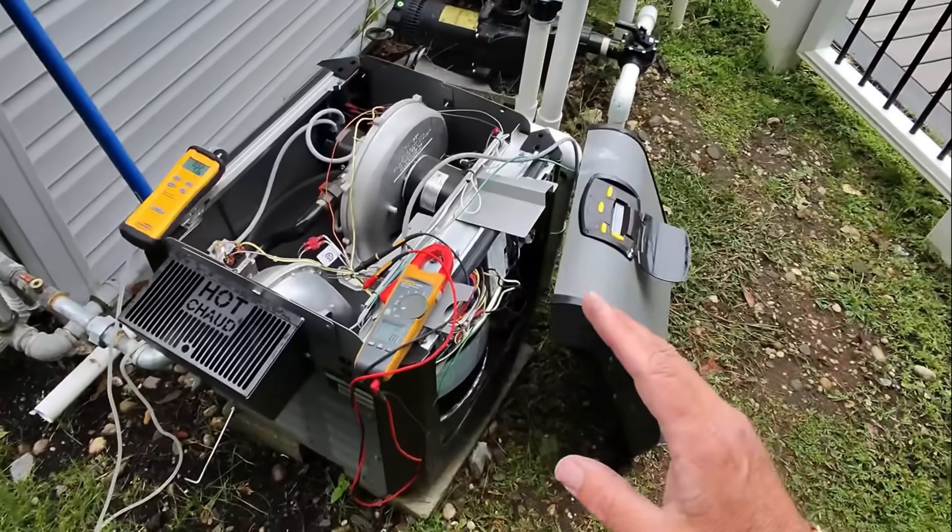One observation: this is a single breaker, which means this heater is wired for 110 volts. If you reverse polarity you're going to get ignition failure — it'll ignite for about a second or two and then cut off with an ignition fault error. What that means is the hot line voltage coming in at 110 volts is actually on the neutral side, and vice versa — because of that, you won't have flame proving and you'll have ignition failure.